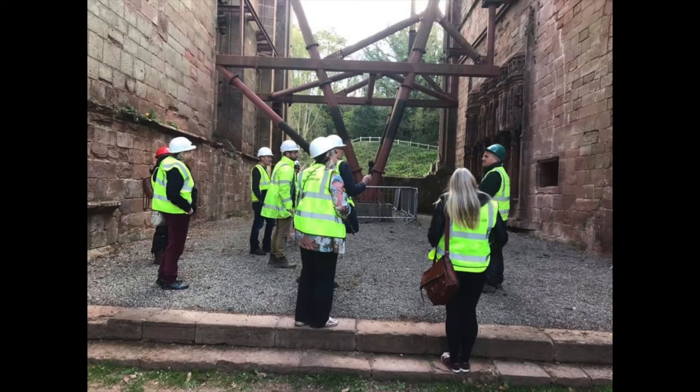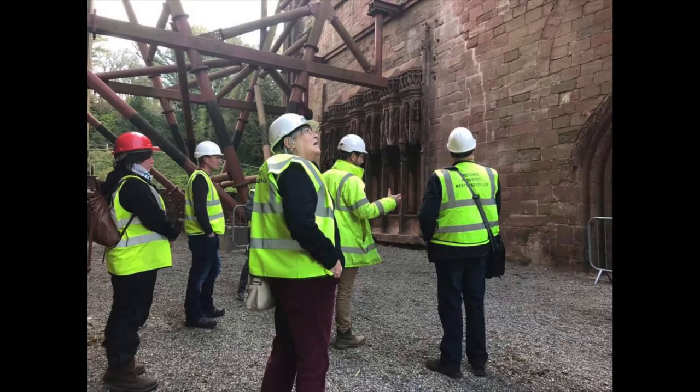One of the main points of this whole project, like I said at the beginning, is grouting this large crack, which you can see by the size of the gallet stones halfway up. At the top it was about 200-300 mil, and it went through the whole wall. You can see right through. Only we're starting down the bottom.